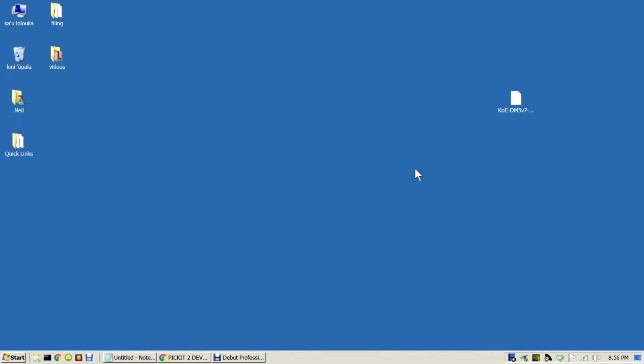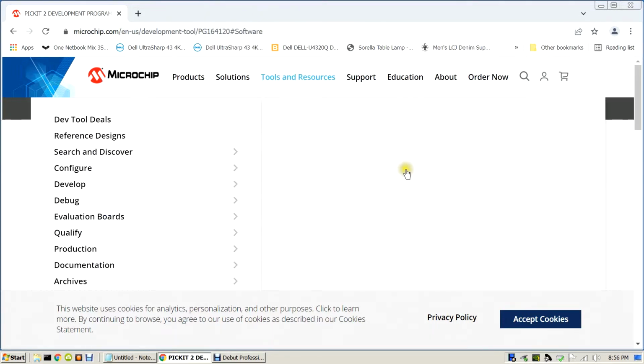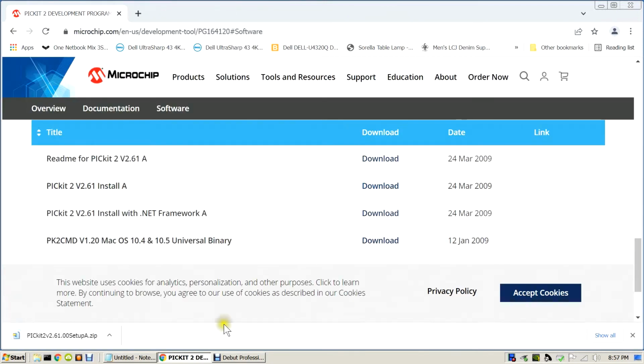You will of course need the software for the PICkit 2, and if you don't have a copy of that, you can get it from this website here, and I'll put a link to that in the description below. Just scroll down to the software section of this page and download this PICkit 2 version 2.61 software. We can just click on that and it should download as a zip file, which you can then extract and install onto your computer.